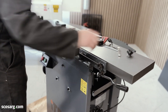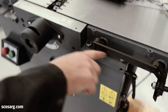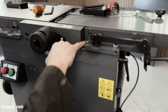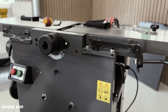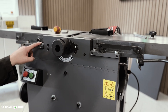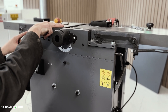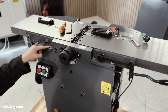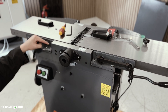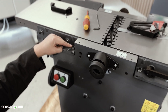The adjustment screws are here and here. This requires a 16 mil spanner, so you'll need one of those too. Same on this side — you would slacken. If this corner here on the front was too low, slacken this bolt and then adjust it with this grub screw here.